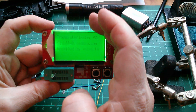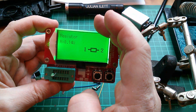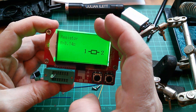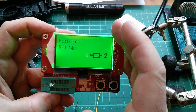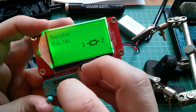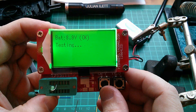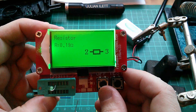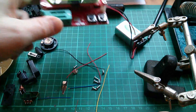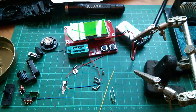Switch on. What have we got? It's showing 0.14, so it's reading as a 0.0-something ohm resistor. That's not right. Why is it not telling me it's an inductor? I suppose that could be a resistor - it just looks like one of those inductors. It's telling me 0.15 one time, 0.19 ohms another time. It's a very low resistance. I do think this is an inductor, but it doesn't seem very inductive. This is actually in series with the antenna - it's really weird that it doesn't show as an inductor.